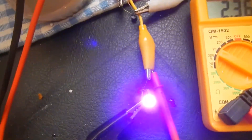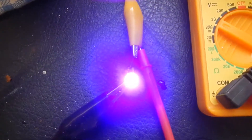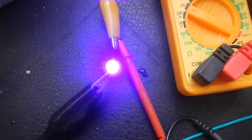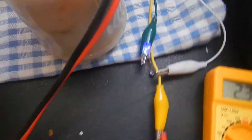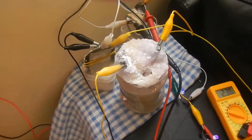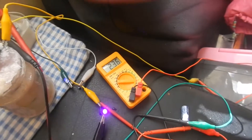As you can see from these constantly lit LEDs, it is doing it quite fast. I've checked on the scope — it will sync up with the timing of the oscillator. Running in full sun here at the moment, about 20–30 kHz on most of these, and it is charging my batteries very well.